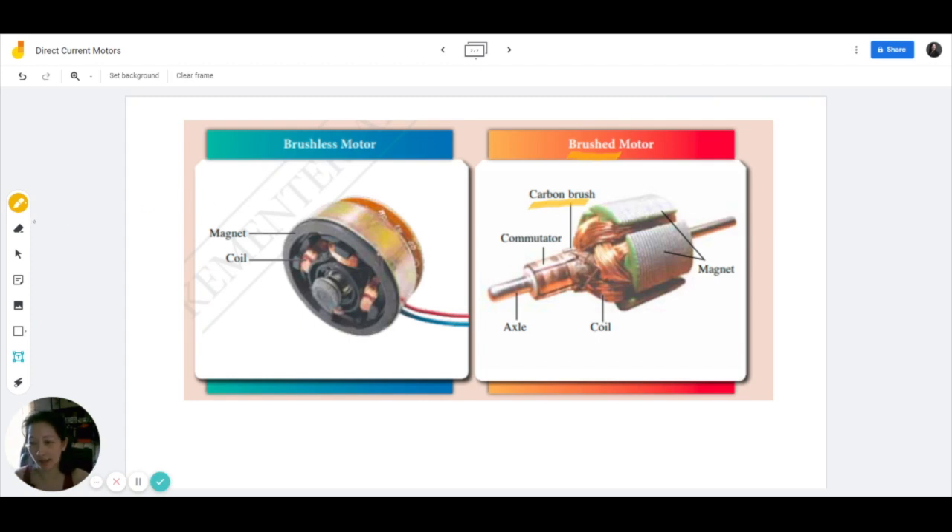If we take a closer look at the diagram on the right side, the carbon brush is this piece over here. There is a matching set on the other side — it's always one pair. You can also see that there is a commutator here, and in fact the commutator has been split into more than two halves — it's split into many sections. The axle has the commutator on it, the iron core is on the inside of the coil. The axle would spin, the magnet remains stationary, and the axle will rotate together with the commutator and the coil.